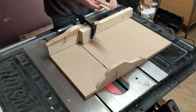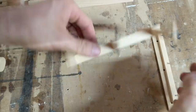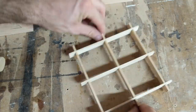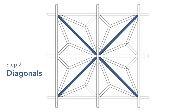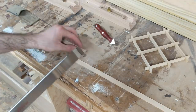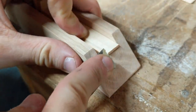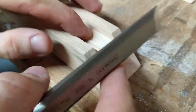Now we can assemble the grid. I roughly measured out the length and width for these four diagonal pieces and cut them slightly oversized so there's plenty of material to work with. Now we can take out our Kumiko jigs and cut the 45 degree angles needed on the ends of these pieces. If you'd like to see how I made these jigs, there's a link at the end of this video and also in the description. There you'll also find a link to where you can buy these jigs if you didn't want to make them yourself.